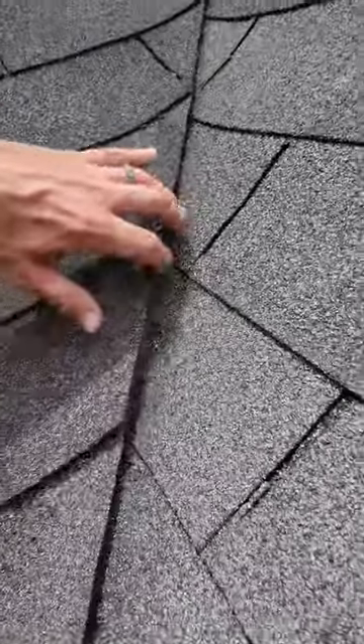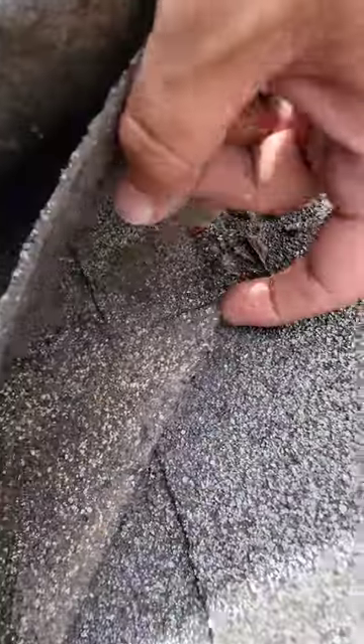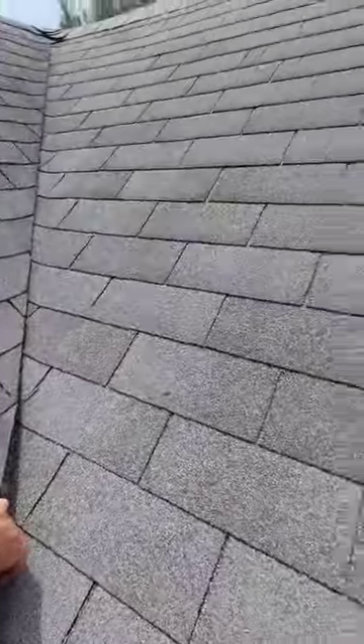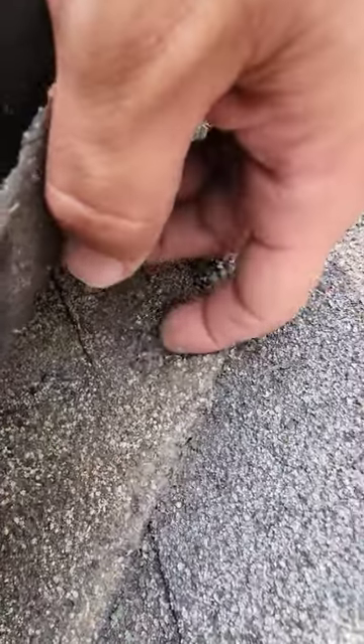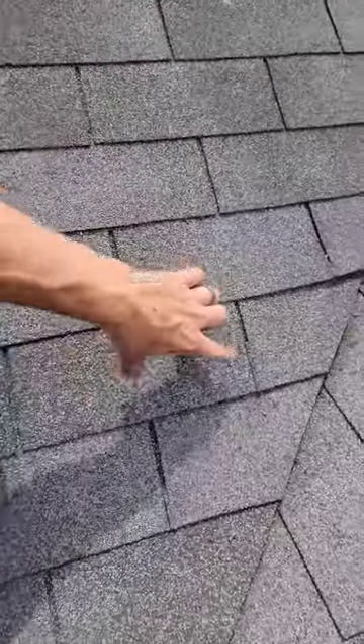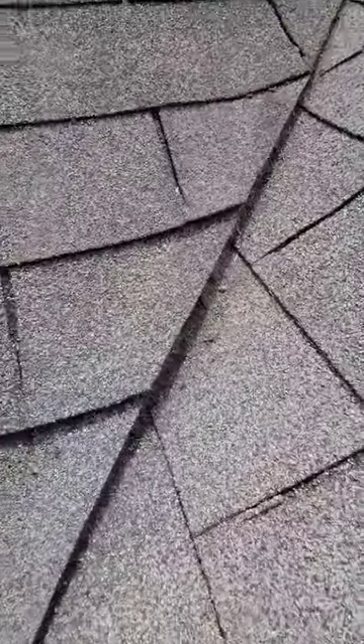Why this is not good, and if you do do it, you really need to make sure that you follow manufacturer's recommendations and dog ear these top corners here. The water coming down the valley from all sides catches this point due to water surface tension, runs laterally, runs up under here. You can see all the debris that's running under. The problem it poses is your nails fastening the shingle down over time rust out, causing a leak. So if you do, you need to actually dog ear and nip these. I'll show you on the other side.